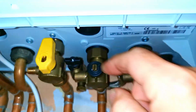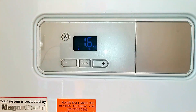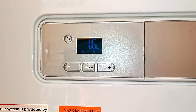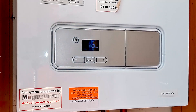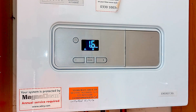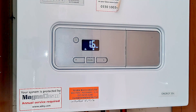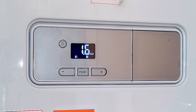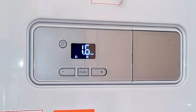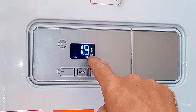Do make sure you close these valves — if you don't, you'll continue topping up your boiler and that will give you more problems. On this boiler, topping up the pressure did get it working again. I'm going to push a button on the front to light up the display, then turn a hot tap on — you'll see the hot tap symbol start flashing and then the flame come on. There we go, the boiler is working again.